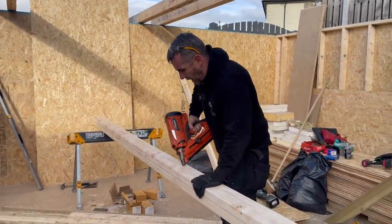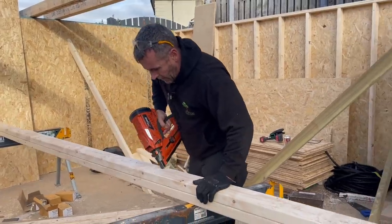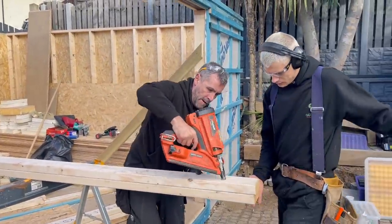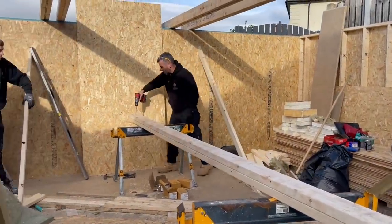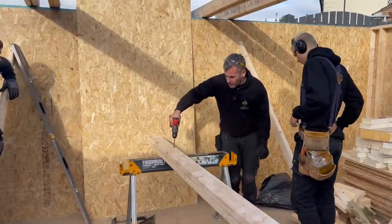He's having to pull it quite a lot because obviously that bottom one was quite twisted. To me, Josh. As I get towards him now, he'll be able to see it anyway, so I won't need to tell him which way to go. And what we're going to do then, I'm going to go down with the 10mm drill bit, just like we did before, through the steel. Josh is going to follow me behind, and he's going to drive bolts into it.